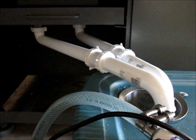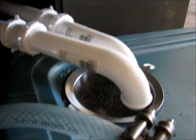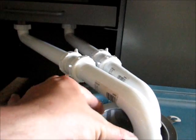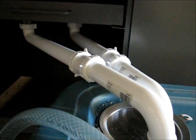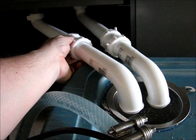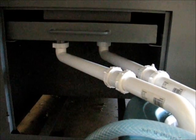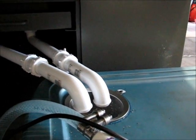I have the downspout attached to the strainer in the bottom of the coolant tray. This is all uncut PVC, so it's a little bit longer than necessary, which is good. I do need to move the coupler back, which means this pipe has to be cut — looks like I want about two inches out of it. With two inches off, the mock-up looks good, so I'll go ahead and install it. The second drain is now installed and tightened. I found it a lot easier to take the coolant tray out of the mill to tighten it down. Everything's ready to go and I'm ready to test it.